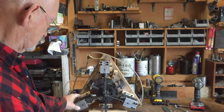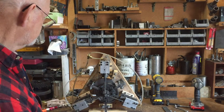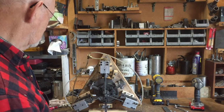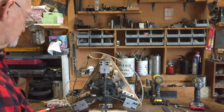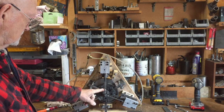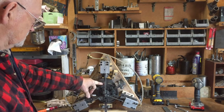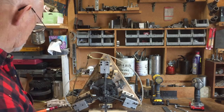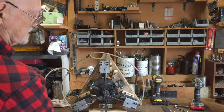The cylinder works okay with the new valves, and the drive mechanism for the valves works okay. It doesn't have much vibration like the first one with the orbital drive — that really was terrible. It still has a little bit of vibration but not a whole lot. I'm going to see if I can come up with some other way of operating this off the rear of the engine to get rid of some of this, so I can have it all exposed and make it push straight down, which I think will eliminate most of that flip-flop. But for what I've got done right now it works — I'm just not satisfied with it.